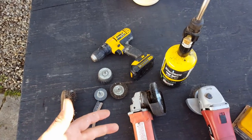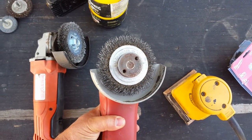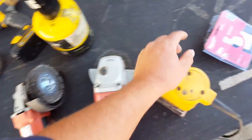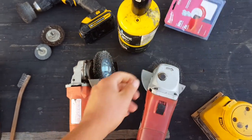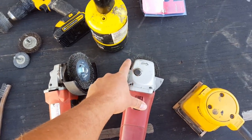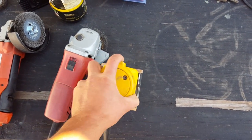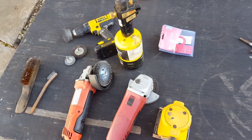Since I don't have a sandblaster, I'm just going to use the tools that I do have available. I actually had this wire brush already for a grinder and it does a really good job — it just doesn't go very fast. So I went and got this beefier one for the grinder, it's about 16 bucks. You've got to be real careful not to dig too much wood out with this, and then I go back in with the finer one to make it pretty. After that I either take some sandpaper or one of these little palm sanders and smooth it out the rest of the way.